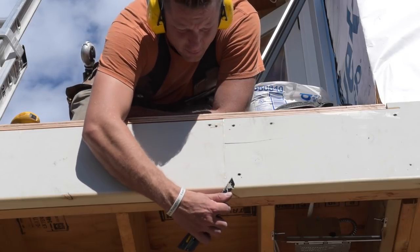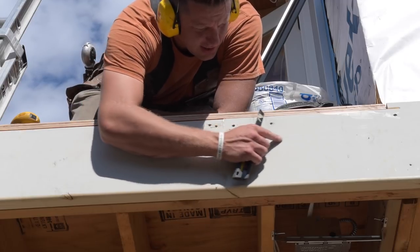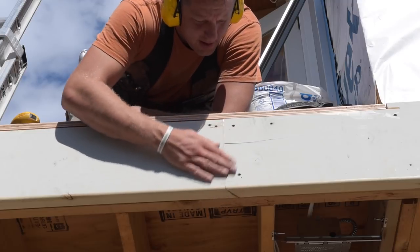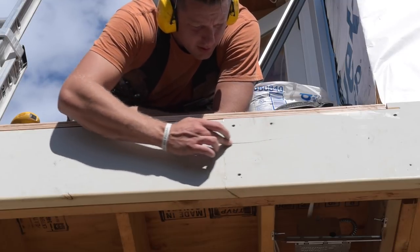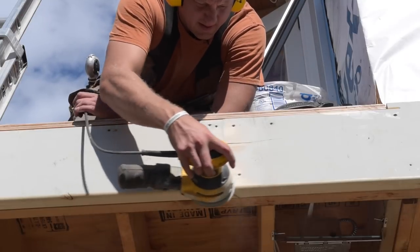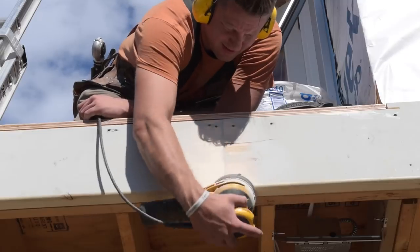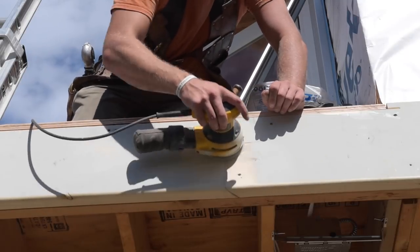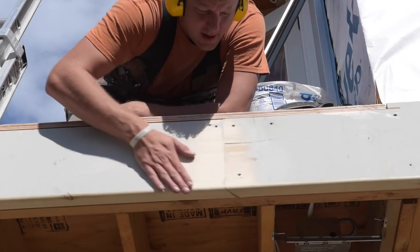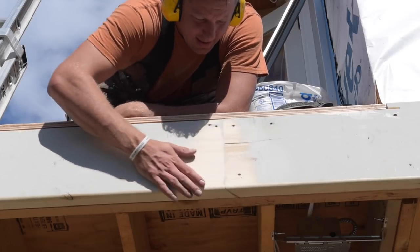And I had to use the full 16 feet on this fascia here, so I couldn't cut out that crack that happened to be at the end. It was the best one I could find at the lumber yard. But I got to fill that with some Bondo before we paint it up. I'll spot prime this, and when we put the top coat over that, you will not even see it.